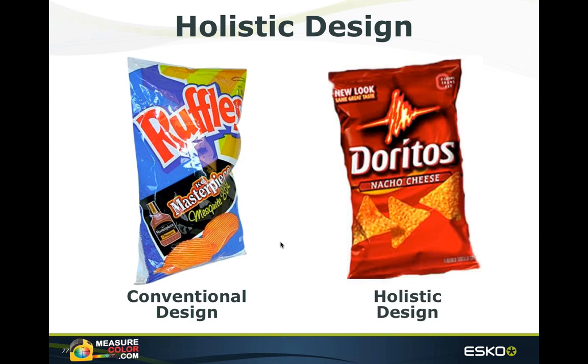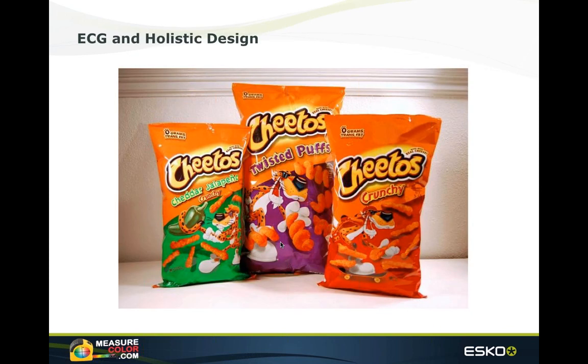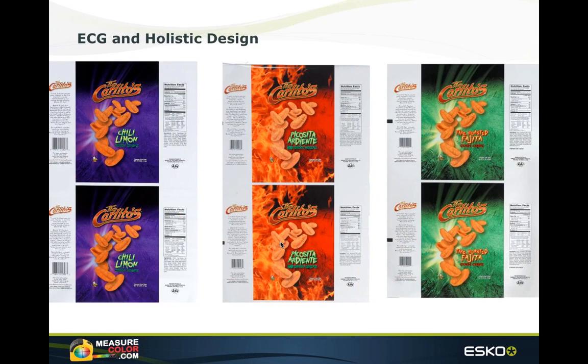And given that, you can see how the designs are starting to change. The job on the left, very clear that the image area is that potato chip, and that you can very clearly see the spot colors. Image on the right, the whole thing is processed. There's blends, there's vignettes, there's gradients, there's drop shadows. And that's why you're going to see the world of design presently and for the foreseeable future change. All these were printed on the same press run. So there's 7 colors in the background, plus that green, plus that purple, plus that red. All this was printed on a 7-color press.